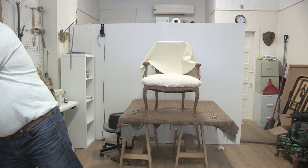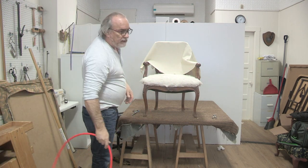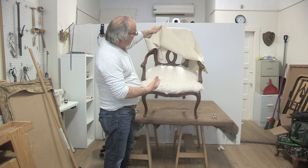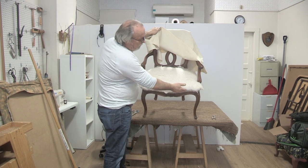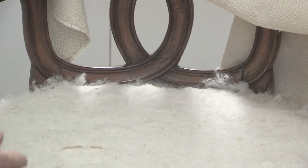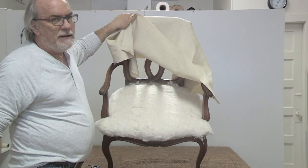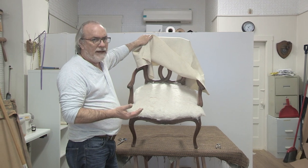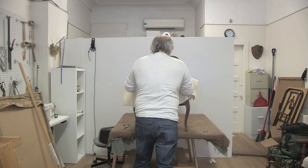In my other videos we don't just stop with stapling - sometimes we pin tack or pin staple. In this case, because the upholstery is so tight to the back rail, I don't think I'll have to redo the back. So I'm going to pull that through, staple it, then pull it forward and pin staple it to the front, because we may have to pull it again. The bottom line is you need to make sure your fabric is tight front to back in order to make the proper cuts.